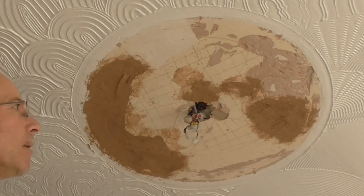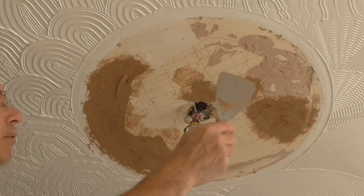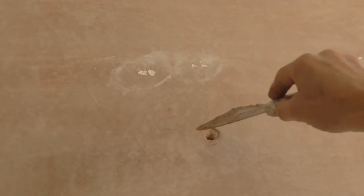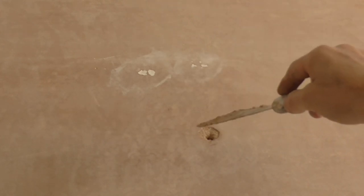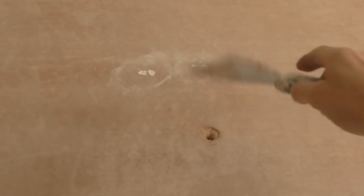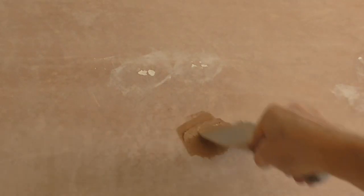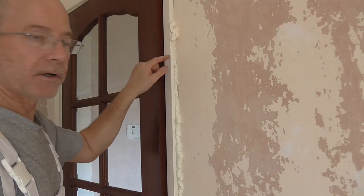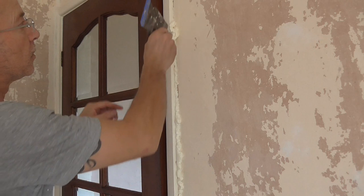I'm going to leave that to dry, wipe it back a bit, clean it off and then that can have some polyfiller over that. Some of these holes on the walls - some are small enough and you've just got your polyfiller, you just do it with them. But if you've got your undercoat plaster out and there's some of these big holes, then you may as well just go around and top them up. Fill them in with this first and then top them up with the polyfiller. And up the side of this door casing where I put the foam in, that's ready to come back.